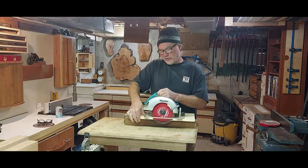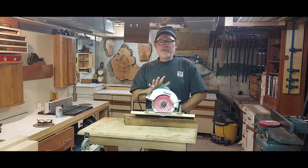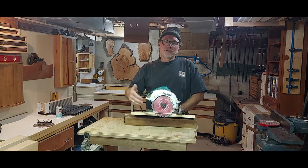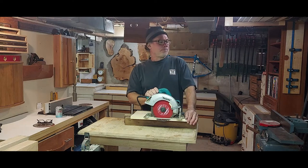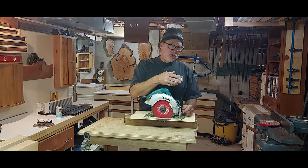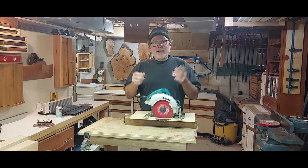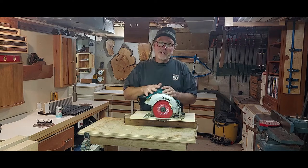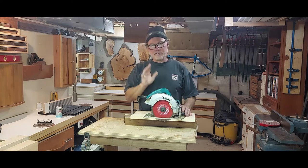When you're going to make a cut, always adjust the depth so you have about a quarter inch of blade sticking through. This is probably the number one safety feature, and it also makes the cut much easier. I had a guy working for me cutting half-inch plywood on sawhorses — the cut kept going hard then easy, with smoke coming off it. When he lifted the plywood, both sawhorses fell to the ground because he'd cut right through them. So make sure you adjust that blade depth.